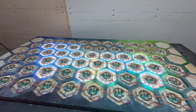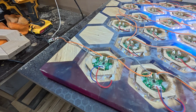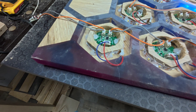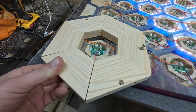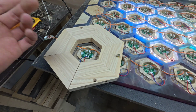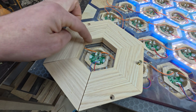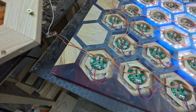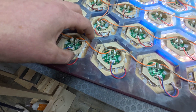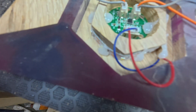As you can see I've flipped over the table and the sensors are already lit up. I have a round sensor and the LED goes all around the edge — that's why I told you you need that jig. It doesn't have to be a perfect jig because nobody's going to see that. You can use double-sided tape or screws to fix the template, then route around the edge. I was using a straight router bit, and there's enough space for everything. The LED goes all the way around.